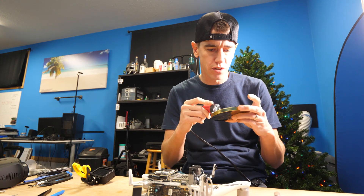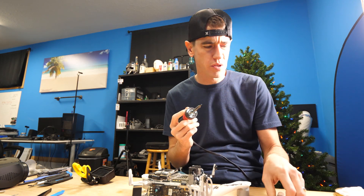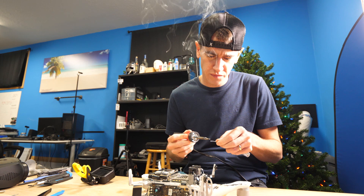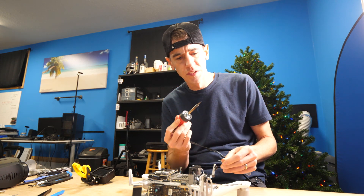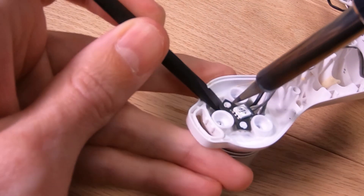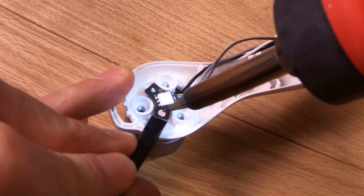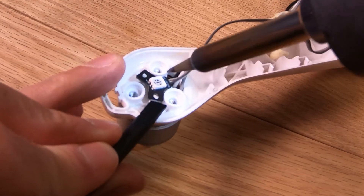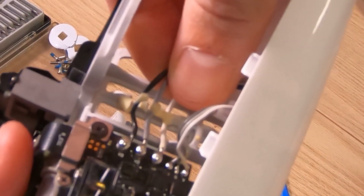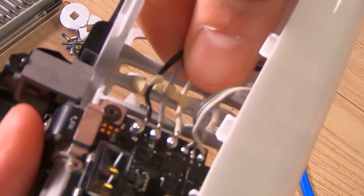You've got to prepare your soldering iron. I always use a little wet cloth to wipe off the tip, and then you're supposed to do something called tinning or flashing the tip — you let it get hot, get some solder on the tip, and it becomes nice and silver. There are two plastic tabs that hold the LED in place underneath the motor. I've used my soldering iron to just melt those tabs a little bit so I can pull those LEDs away. I don't want to cut that plastic away because I'll need it to reattach those LEDs later. There is silicone holding these wires to the frame — just slightly pull that off, and you're going to need to desolder the black, gray, and white wires. Leave the smaller ones below; those belong to the LEDs and we don't have to take those off.